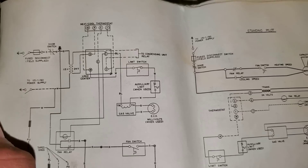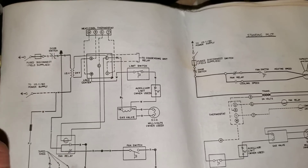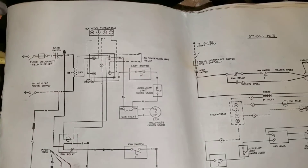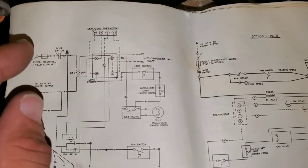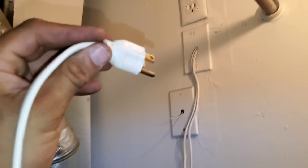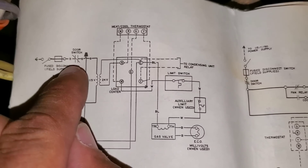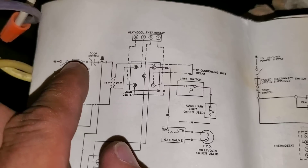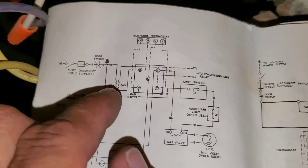I'm going to start with something simple. If you look here, you have your power supply — this feeds your entire system. You can see there's 120 volts coming in, with W and B which is your black wire. We're going to look at the wires feeding the incoming voltage to our system. For safety reasons, I already unplugged my system — it plugs into the outlet right there to feed the system 120 volts. This is my door switch; I have two lines coming off of it — one goes to my black 120-volt wire coming in, and the other ties into my transformer.